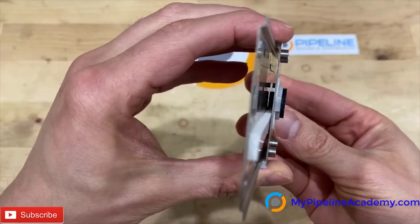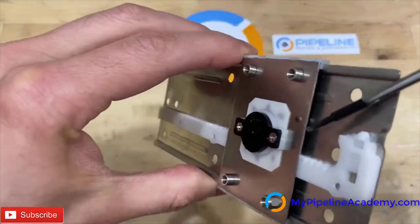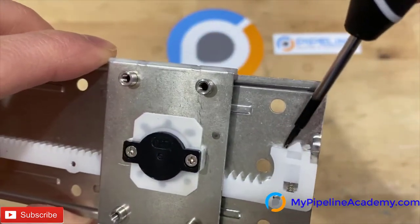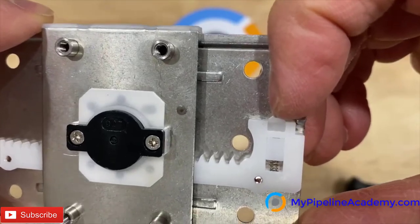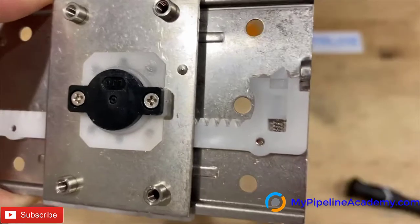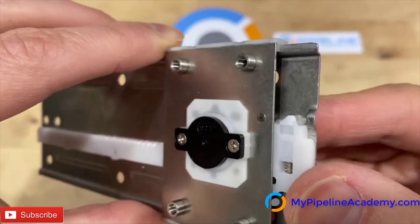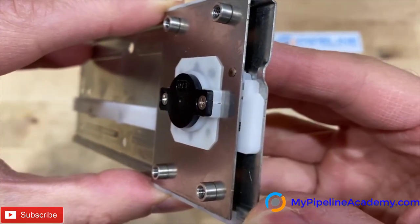All right, so as the rack and pinion goes, that pin on the inside there will encounter this ramp. And when it encounters the ramp, it'll come in contact with that face and it'll push the ramp down. And there's a spring, as you can see in there. We call this a passive lock you're about to witness. So bam, it comes in contact. It pushes the ramp down.